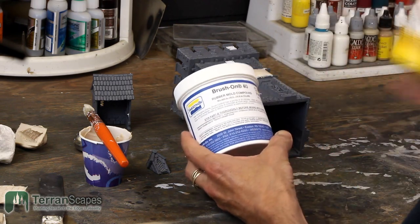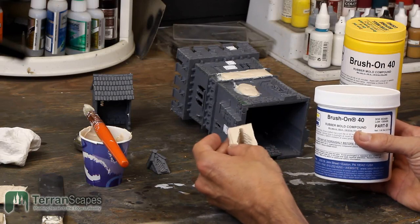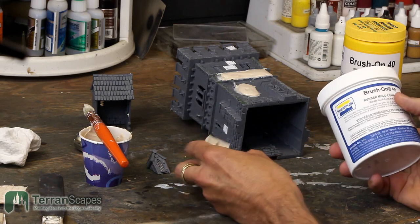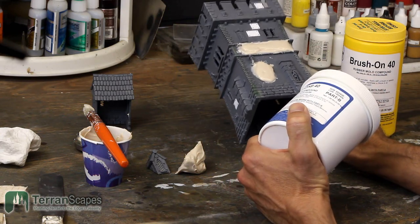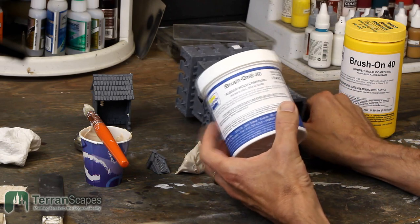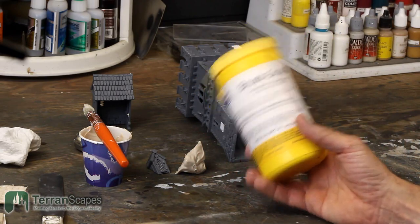Hopefully you learned something about Brush On 40 — I do like it. I haven't cast into it yet, but it shouldn't cast any different than other materials I've used. With urethanes they're not self-releasing, so I'll be going back to the Sonite and making sure I give it a good coating of wax, then spray a mold release over that, so the urethane doesn't stick to the urethane. I've had good results so far. It has less sagging than many brush-on rubbers straight out of the bottle, but you sacrifice a little working time for that. The ability to do something like this all in one go is a really big advantage. I will probably be going back to Brush On 40 in the future — probably have a couple months before this part is corrupted by moisture, and that's the problem with urethane rubbers: you've got to use them up. This gives you a look — almost a mini tutorial — on Brush On 40's consistency, how to apply it, and the end results I've gotten from it.